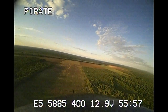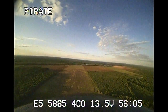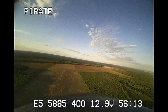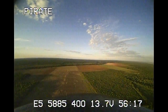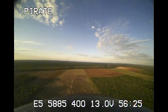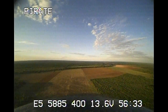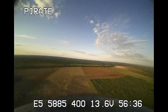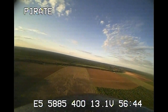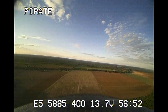This little transmitter running at 400 milliwatts does get smoldering hot rather quickly on the ground — so I know it's definitely putting out a lot of RF power. They actually tell you not to run it transmitting if you're not flying or don't have some kind of airflow to cool it. I use the 0.1 mW low output bench mode while setting things up. We're running 400 milliwatts just until we got everything tested and to remove one more bit of risk. But I'm confident now that if I lose video the return to launch is going to bring everything home just fine. We may experiment with some of the lower power modes later — and we can also run the R9 in low power and fly out looking for a failsafe.